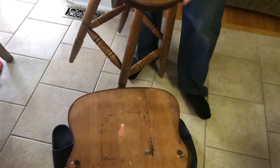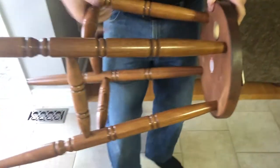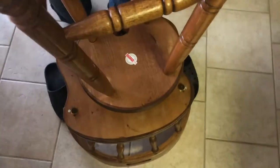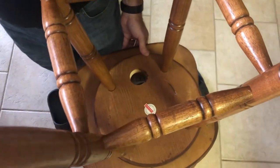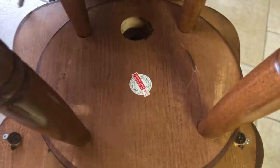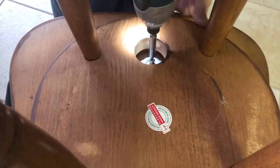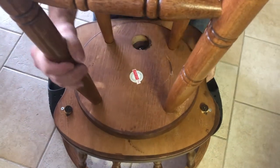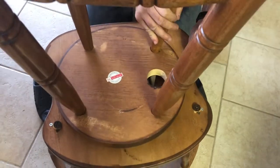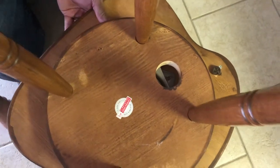Remember that these aren't the original holes we're doing here. We're going to try to line up that first one — there's a notch on most of these chairs in order to screw it in. We want to make sure that first one lines up with the first new hole we've got. I'm not going to drill it all the way in because I want to make sure all my other ones line up. That way, just in case I have to play with it a little bit — put the washer exactly the same as the other one. All you do is turn it to the other hole. That's why you don't tighten it all the way — just in case you need to move it a little bit.